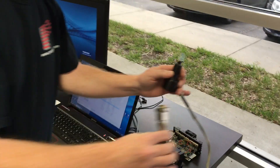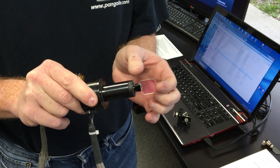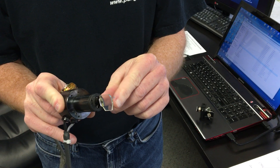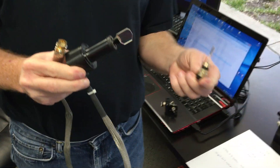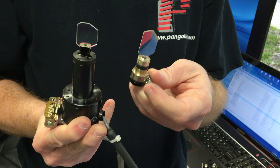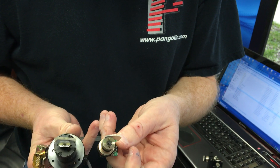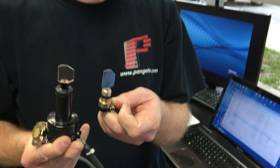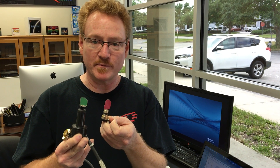In a typical situation, this is a scanner that would typically be delivered for a 10 millimeter application. It's very physically large — the mirror is about this big, this scanner weighs 240 grams, and the mirror and mount weighs 3 grams, so it's quite heavy with a very heavy cable. By comparison, here's our little compact 506 — the entire scanner weighs 12 grams. The mirror is actually bigger than the scanner. We use silicon as a mirror material instead of glass. Silicon is a space-age material used for semiconductor chips — it's stiffer, lighter, and smaller.